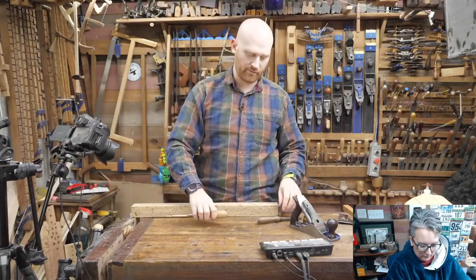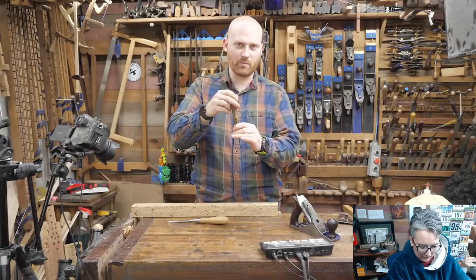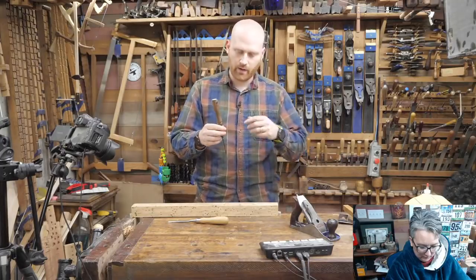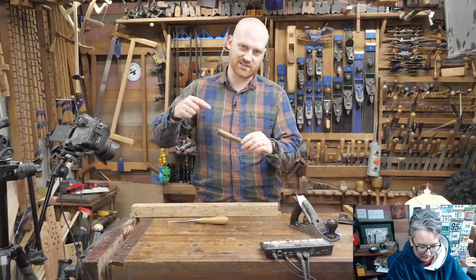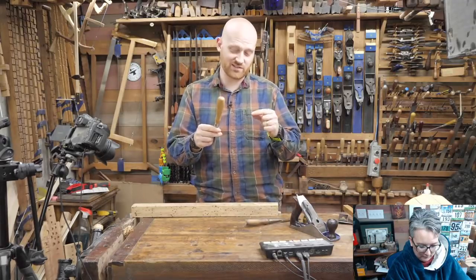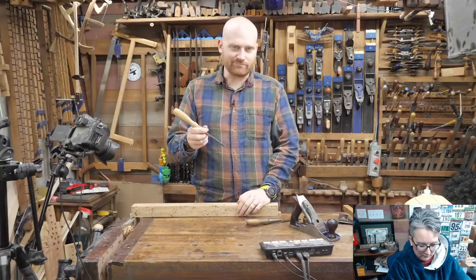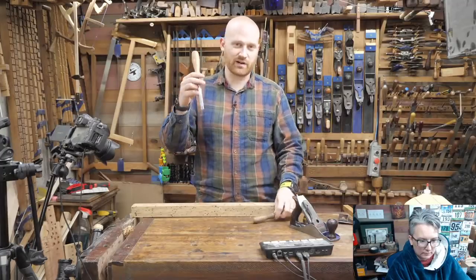I generally prefer tangs because they don't fall off whether you want them to or not — you can pick them up by the handle, never fear. With a socket, you never pick it up by the handle because the moment you do, that's when it falls out and you have a chisel running down at your foot. But socket chisels do have a really good feel because every time you pound on it you're actually setting it in deeper, whereas with a tang there's a chance you're actually going to split it. Tang versus socket — honestly, it doesn't matter that much, though you're going to find a lot more tangs.